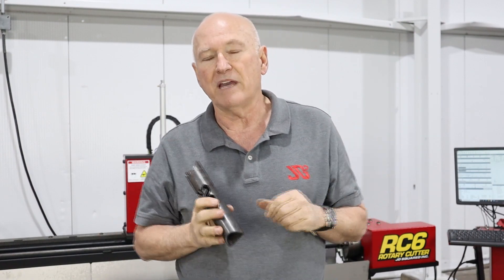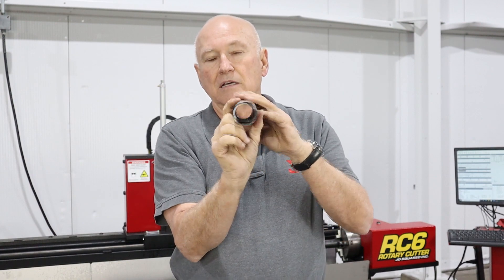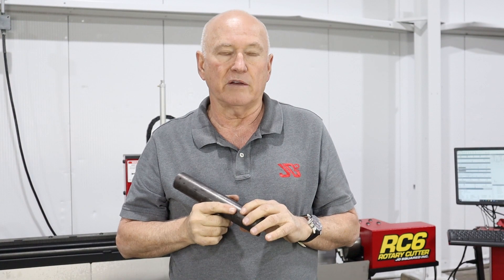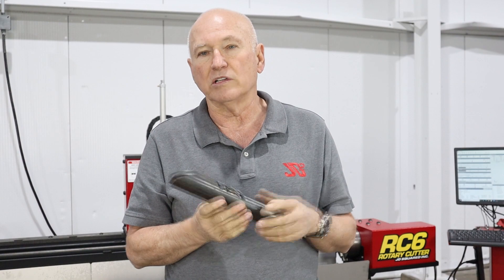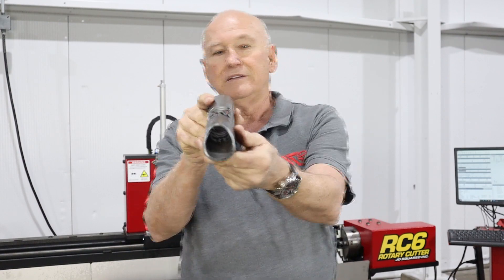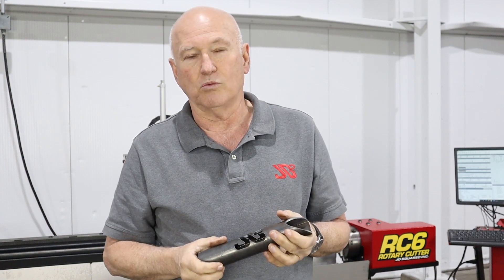The reason is that when the plasma cutter is cutting through the top surface of the tubing, all of the spray and vaporized metal is impinging on and heating the other side. Plasma cutter manufacturers base their cutting table speeds on room temperature metal. However, since we've heated the other side, by the time we rotate 180 degrees we are no longer cutting room temperature metal — we are cutting very hot metal. Therefore the cutting speeds no longer work properly and you end up with more dross. Water injection helps alleviate that problem by keeping everything cool. You also notice virtually no smoke with a water injection system. I hope this video has been some help to you. Thanks for watching — have a great day, goodbye.